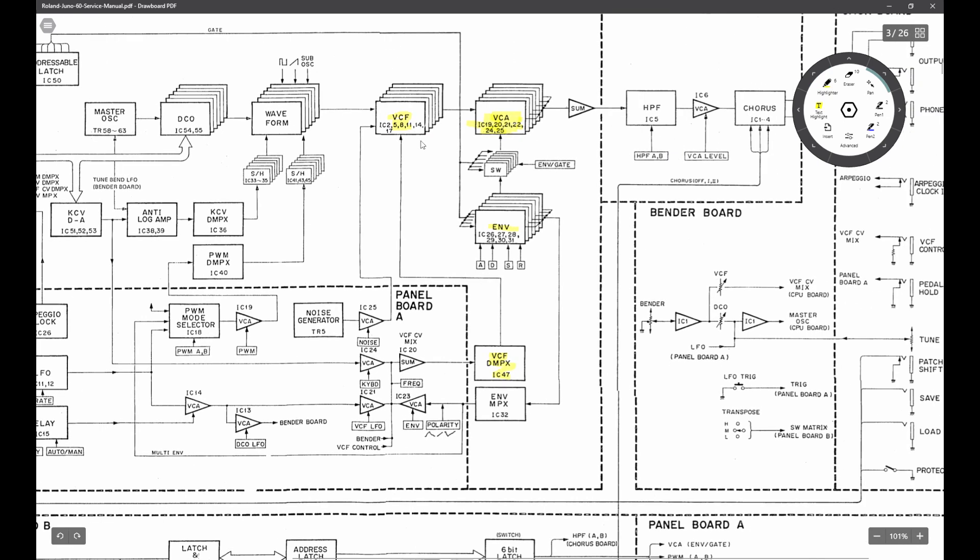So let's see what we can find. The question is: where do I start? Only one of the VCFs is showing this behavior, so the shared part is not it — because then it would show on all six filters. So it must be in the individual filter section; that's where I'm going to start.